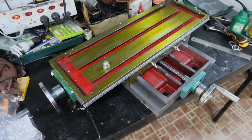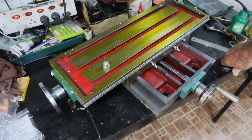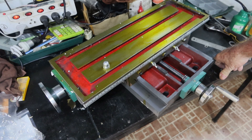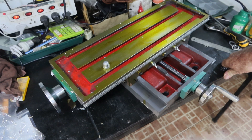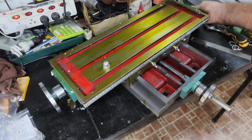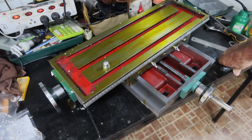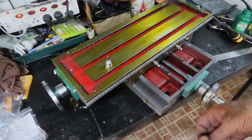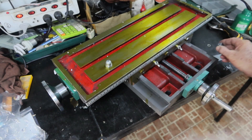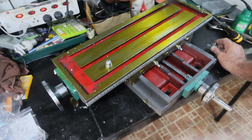The handle — shake it up and down — it's all over the place. So I think the first thing I'm going to be doing with this is pull it all apart, try and clean these edges up, just file the edges off a bit, and maybe try and find some bronze bushes or some bearings. I'm glad I didn't pull the mill apart — I left the old table on there on the off chance I might have to machine something up. I think what I'm going to have to do is get some new lead screws to replace these, because that's just bloody rubbish. The other side — the x-axis — is not much better; probably best part of a quarter turn. See what I can do about making them better. In the bag there were handles, mounting bolts, and also a thrust bearing — I don't know where that's supposed to go, whether they just give it to you as a spare or not.